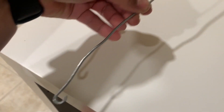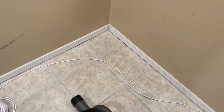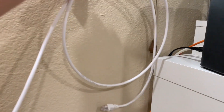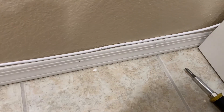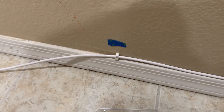I recommend you use painter's tape to help protect the head of the cable as you feed it through the hole in the drywall and not damage the connector clip. And finally, it will help to have something rigid to help pass the cable through the wall, as the cable is too soft and pliable. I'll start routing the cable from the room the modem is located. I have plenty of cable so I will make sure to have at least a foot or two extra just in case I ever need to move the modem. I will be placing the staples every 16 inches to help secure the cable, but later in the video I will show you how you can create a more permanent bond to the baseboard.